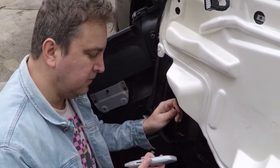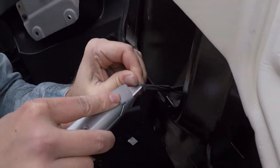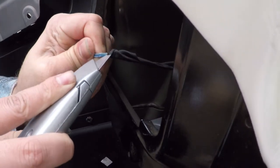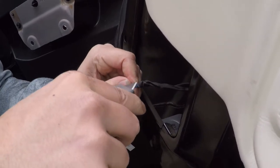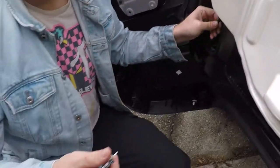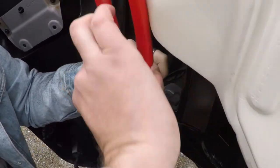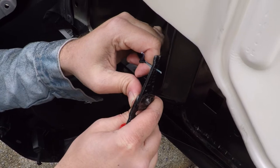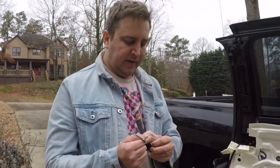To give ourselves a little more room, take an X-Acto knife and just kind of cut this jacket right here — cut away from yourself like that. You don't need a whole lot of room, just enough to strip and solder. Try to get a little bit out right here, and just like that we'll have enough space. Then take your wire strippers, lightly strip around this right here, push the stripper away while holding the wire, and pull. Same with the other side. Next, we're going to use the jumpers that came with the speaker kit.